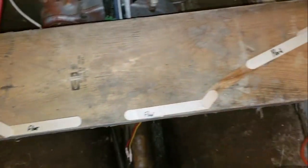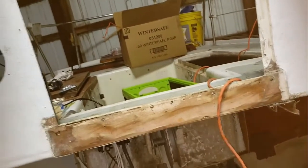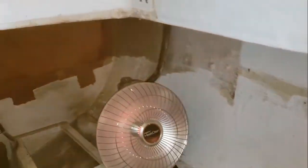I really need to figure out a way to get warm in here. I'm thinking about getting a drop cloth or a moving blanket and putting it over the hatch to insulate a little bit and keep more warm air in here. I just have this reflective heater and another space heater, but you don't want to leave space heaters plugged in unattended — they draw a lot of energy and if your extension cord can't take it, that's how you melt wires and how boats burn in storage.